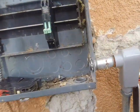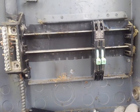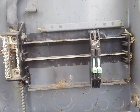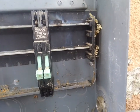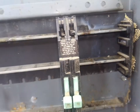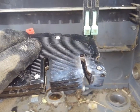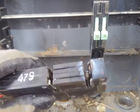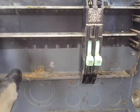Let's look at this panel. I wanted to show everybody what goes wrong with these and why they're no longer used and why they should be replaced as soon as you can get to it. This is the main problem — you see there's bad contact on these spring connectors that causes this thing to arc, get hot, and melt. Luckily this one didn't catch fire, but I'm sure there's a little bit of smoke on here.